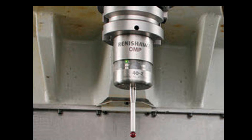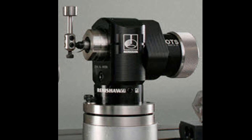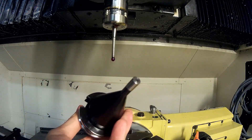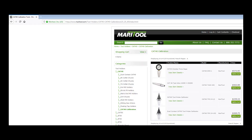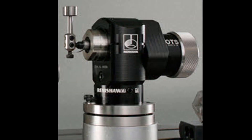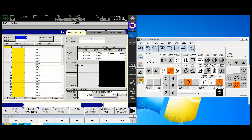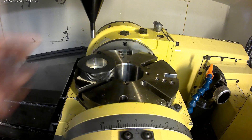Now my spindle probe is all set and ready for the calibration process. It's time to start focusing on the tool setter. This tool setter requires a tool of a known length — I choose to use a gauging standard. This one is from maritool.com. It measures four inches gauge length and 0.3 inch diameter. If you don't have one of these, not a big deal — all you need to do is grab a gauge pin, stick it in an ER collet chuck, and measure it the old-fashioned way using gauge blocks to find the exact gauge length of that particular tool. Before I use this tool for calibration I want to make sure I register it in my library and populate the height offset with the accurate length of the tool — in this case four inches.